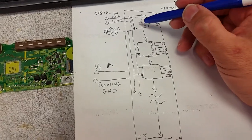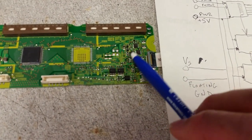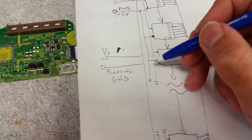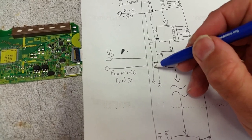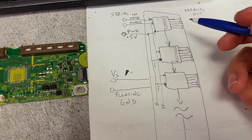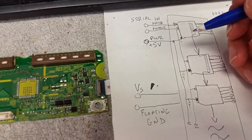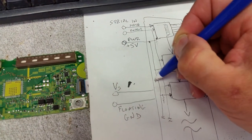What's more, in case of that buffer board, there's a little bit more logic outside of the ICs. This is not so common for buffer boards. Many, many of them don't have any of that. They just have the ICs. But even in that case, very often on the power here, there are small capacitors on each one of them that are just noise filters that are close to the ICs. And sometimes those could have shorted too. And there is simply no easy way to tell, was it a capacitor? Was it some of the ICs? Which of the ICs? And this is exactly what has happened with that board. And again, this is a customer's board coming back to explain what we are doing and why. The way to solve that is basically you just have to interrupt the connection between, usually you try in groups here.